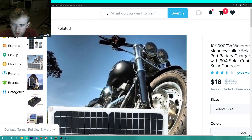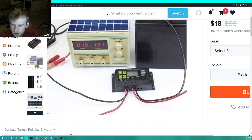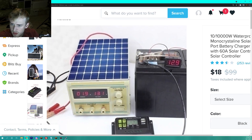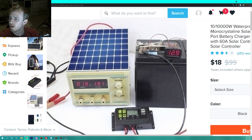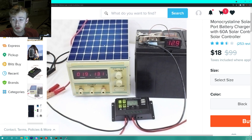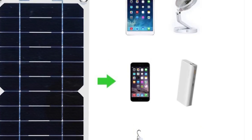Going back to the schematic of what you're supposed to plug in: it connects to loads and to the solar panels. But looking at what they're actually testing — that wire goes into the battery. And it looks like the black lead and the red lead are both hooked to the same battery, going in both ways. That doesn't sound like a particularly good idea.